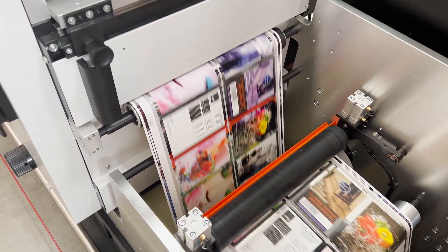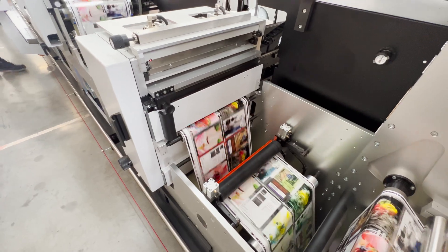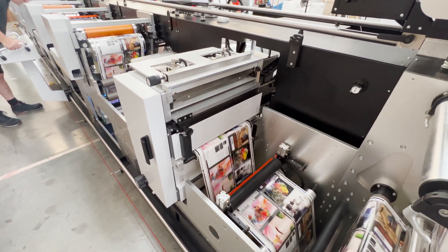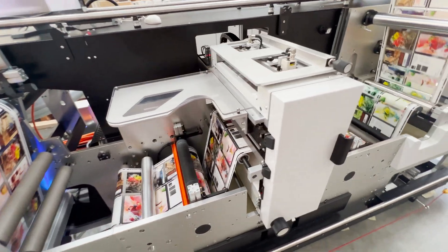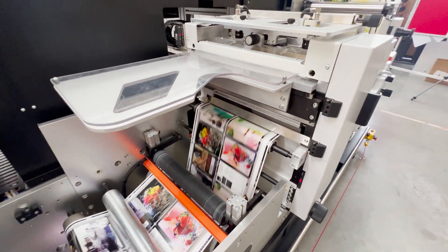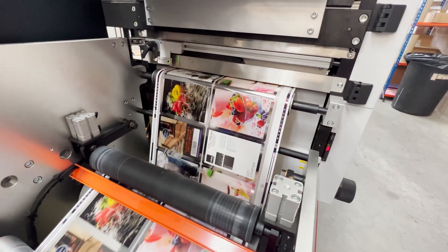There's no need for heavy die moving equipment, and the skill levels and setup time needed to mount dies is reduced. This module really is a fantastic way of using automation to massively improve your productivity, especially with ultra-short label converting, and enables your flexo press to also be used as a digital print finishing line.